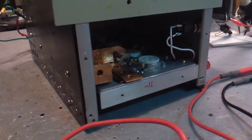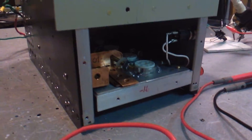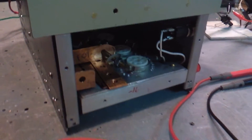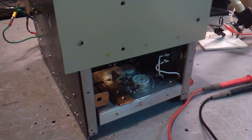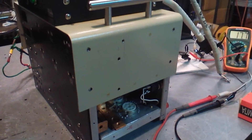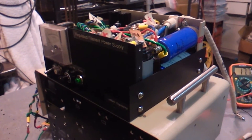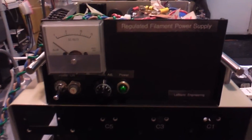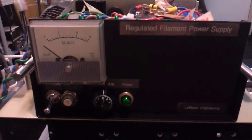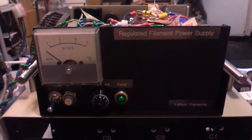Here's a peek inside the case. It's going to have a copper bus system for radio frequency ground. It's got a crystal that you can change out, and it also has function generator inputs. You can run a BNC and run different frequencies. It's basically an ISM power supply to run industrial, scientific, and medical experiments, or whatever you need. It's designed to run from 6 megahertz up to over 27 megahertz.